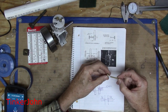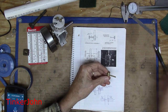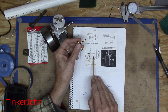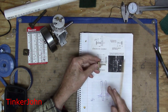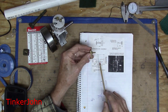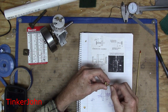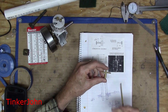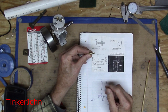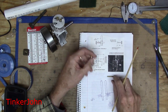I've just got back from the milling machine after reaming out the one-eighth inch hole that goes across, and now I've got a piece of one-eighth inch brass that's going to go through here — those are the two pieces off to the side. This will have to be drilled all the way through and lined up all the way across. The first reaction would be to just drill it through and put this piece out through there and solder it together — but you can't do that. It has to have that middle part in it that goes all the way down. This thing has to be made into two pieces.